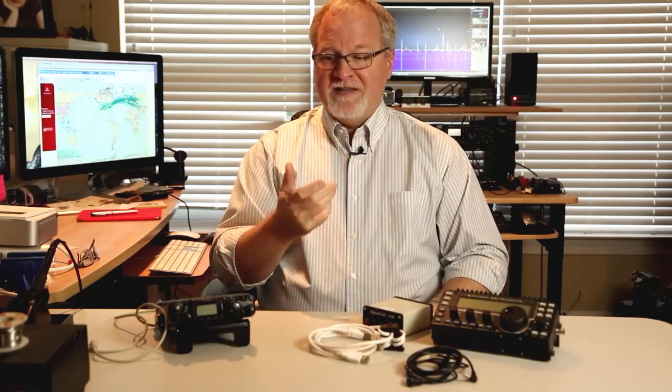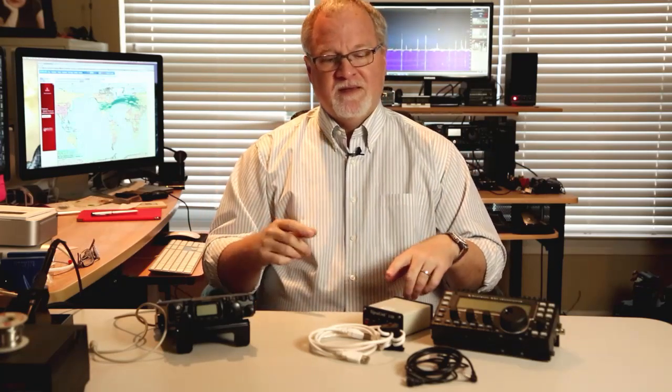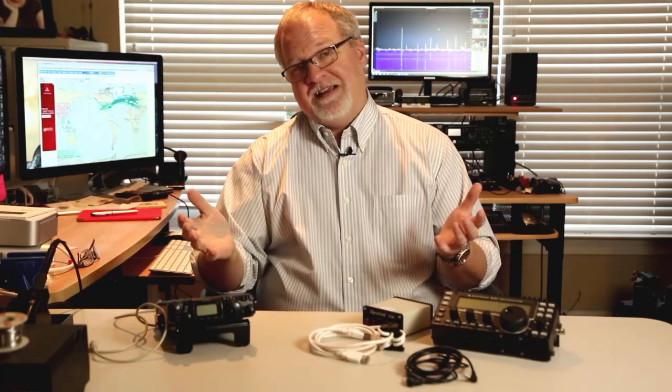All right, now this leads us to the push-to-talk problem. With a microphone, you key the mic and you start talking, and as long as you're holding the push-to-talk button in, your radio's flipped into transmit mode. Anything you say is going to go out into the world. When you let go, you're out of transmit mode, back to receive mode. Well, how is the computer going to push that button? I think we could all agree that the most awesome solution would be some kind of computer-controlled robot finger that would push that button, but that's not going to happen.